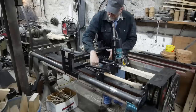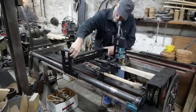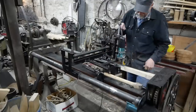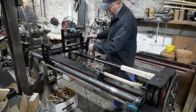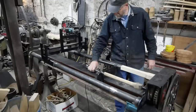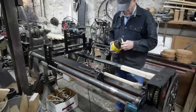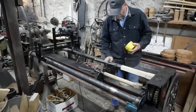Turning these spokes, I'm going to try to get the platform of this carriage parallel to the spoke. It's not really a critical thing, but it just kind of keeps the saw blade square as it's cutting. And to help the carriage slide smoothly, I keep both rams pretty well coated with Johnson's Paste floor wax.